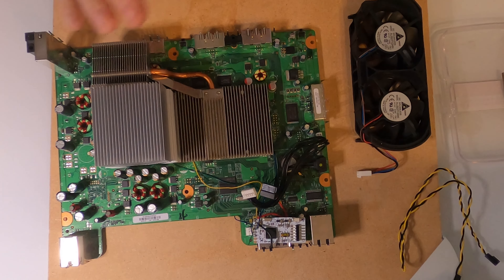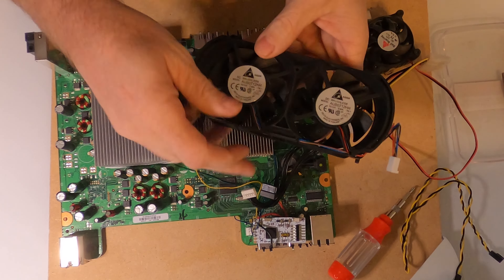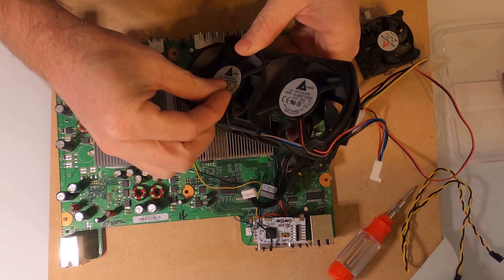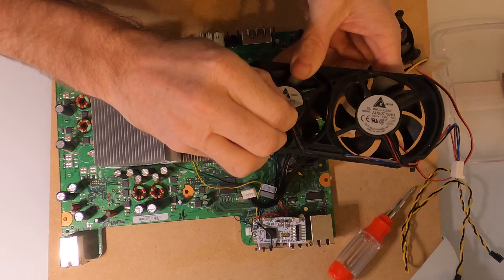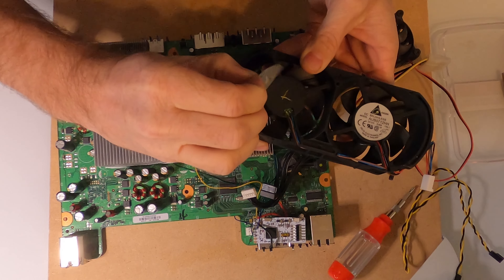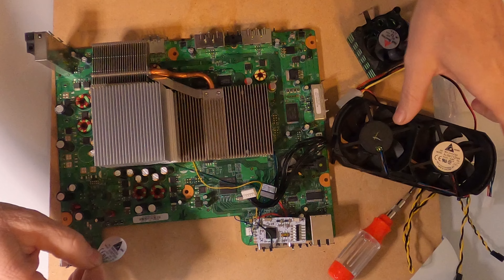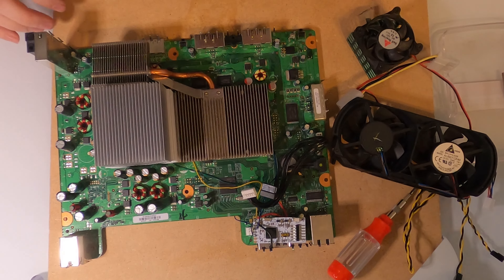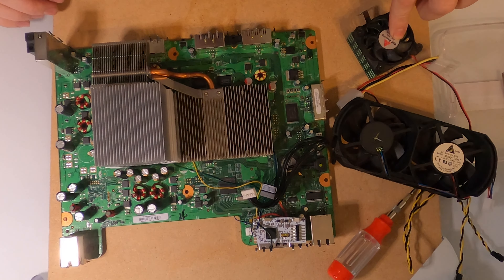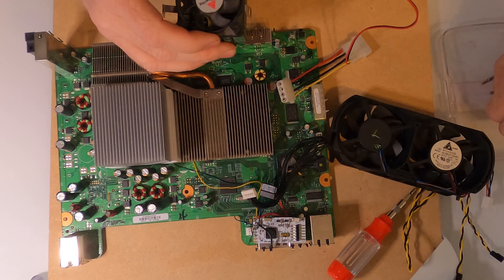I don't really want to modify the board itself. My plan is to modify the fan — if I pull up one of these stickers, I can get underneath and just solder two new wires in parallel on this fan, pulling the same voltage off the fan and directing it over here. Both fans will continue to run. These two fans are already running in parallel, so I'm just adding a third smaller fan to run in parallel.